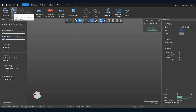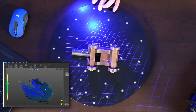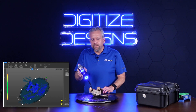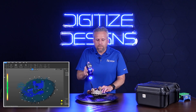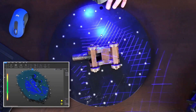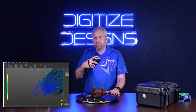Actually, this time I'm just going to show you — I'm going to jump right into scanning. You see it's acquiring the markers at the same time it's actually scanning. If you're scanning for very high accuracy for metrology-type applications, then it's probably best to scan the markers first, and also if you want to use a clipping plane. But you can jump right in and just start scanning. One big advantage of markers too is that if you lose orientation — if it can't see enough markers — it simply stops scanning.